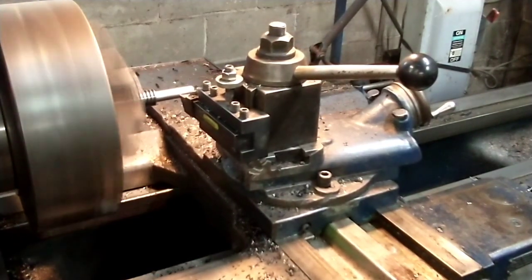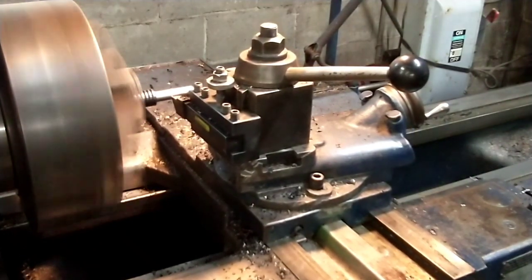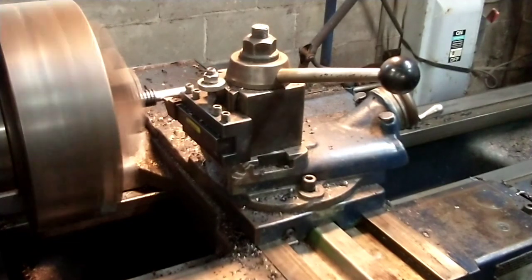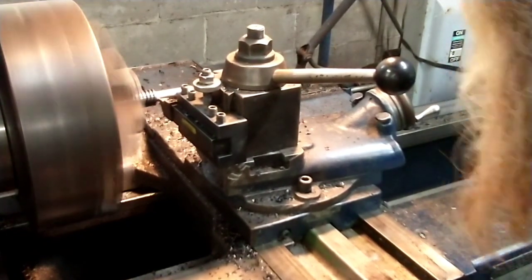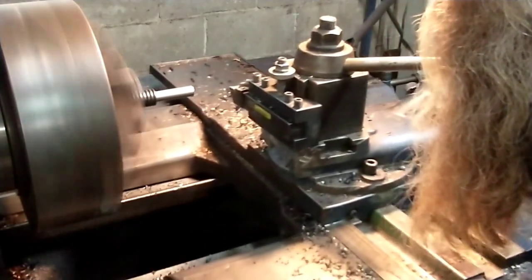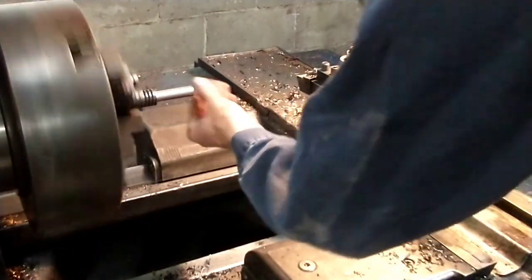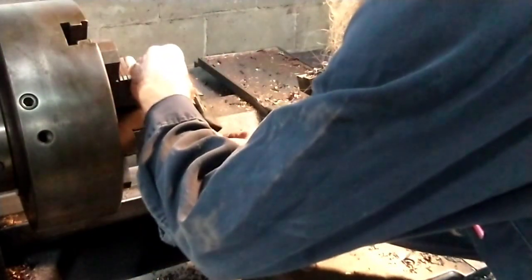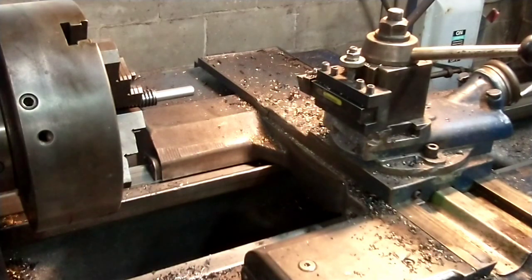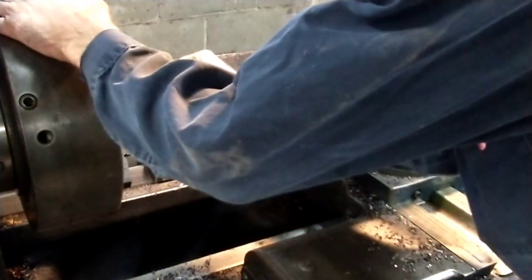Assuming some kind of a handle, but I don't really know. It might be a drive gear, depending on if this is one of those 90-degree jack setups. And if their gear has a bore that's dead on, they might have this undersized so that the gear is a slip fit on there. The only other thing I want to do here is a little deburring while I'm in the lathe.